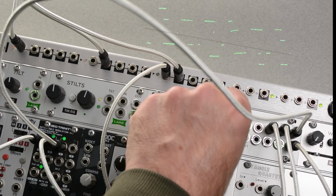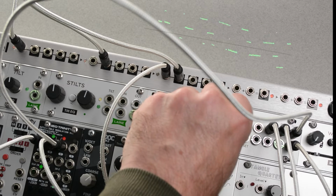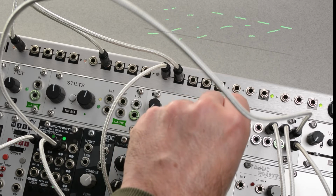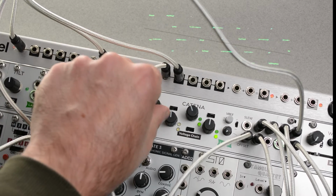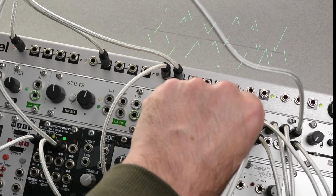As well as offset voltages available from the main channels, there is an extra offset control that adds the selected VREF simultaneously to channels 2, 3 and 4. Even more interesting is that there's also an external input jack for this offset, which breaks the VREF as the source, and the pot becomes a level control for this external input.